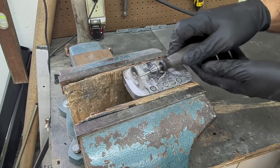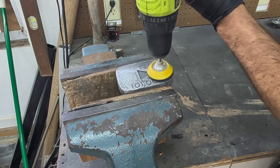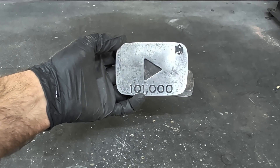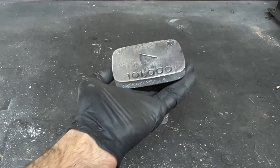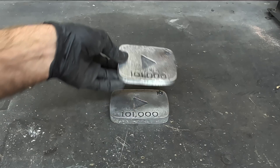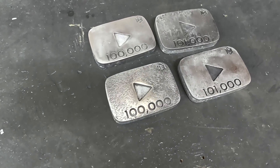I'm going to be using two different techniques on cleaning these up. For the first logo I'm using a Dremel tool with a wire wheel attached. For the second one I'm using a 240 grit sanding disc on a drill. I did use the 240 grit sanding disc and some polish on both, but I didn't use the Dremel wire wheel on one because I didn't want to take away the darkness from the recessed area. I could have used the wire wheel on both and then applied an aluminum black finish later, but either way they both came out really good — just as good as the 100,000 subscriber logos.